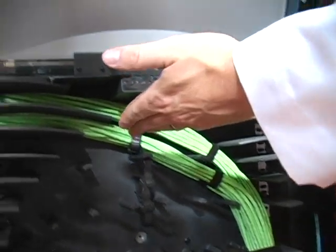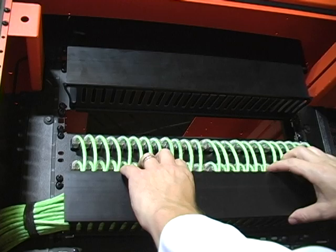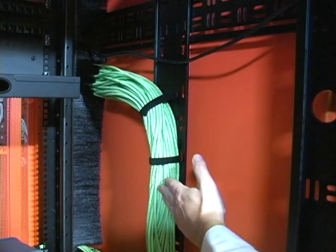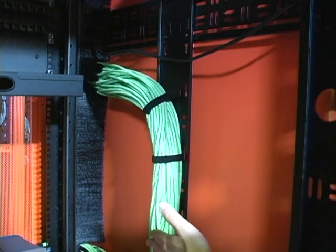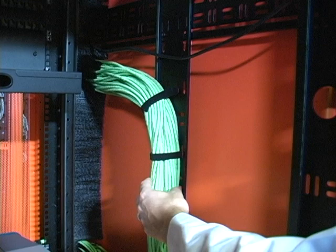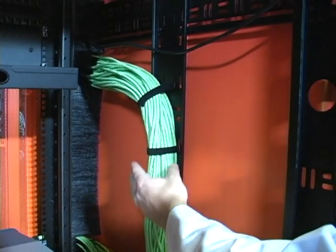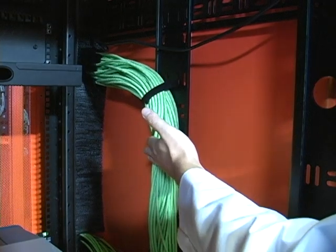Now as you can see here, neatly dressed, the cables get longer as we go down the ports. I like to add roughly 10% extra for total length. This can account for cable routing as well as having a large bundle of cables — that could add a little bit of distance. And don't worry if that adds a little bit too much, because with the staggering right, everything's going to run in parallel and dress very nicely, as you saw on the front and the back. Everything will stay uniformly together.